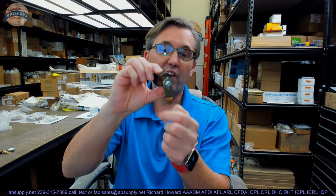So this is basically just a standard mortise cylinder housing, except it's slabbed and it's lost motion. Lost motion is a fancy term — and we all deal with lost motion function probably every day. Lost motion means that when you turn the key, you can effect a change, you can throw the bolt. When you turn your key back, the bolt doesn't get dragged along back with it.